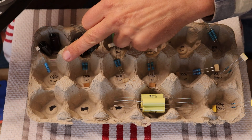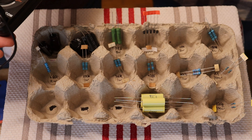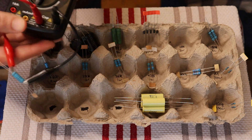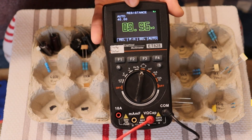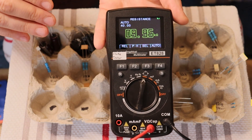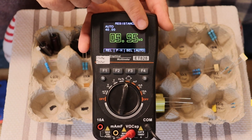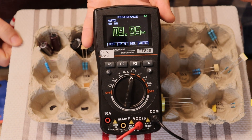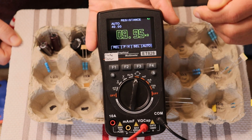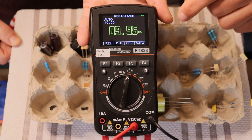With very high values like 680,000 ohms, even at plus or minus 1%, they tend to have looser actual values and might be slightly outside spec. When it's important, we match them for you. Be careful about auto-ranging on these meters — there are some resistor values that are very close to each other, like 200K and 200R. They may both show as 200 on the display, but pay attention to that last symbol. 200R just means 200 ohms, while 200K means 200 kilo-ohms — 200,000 ohms.